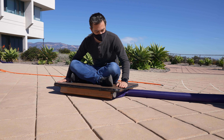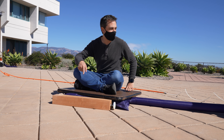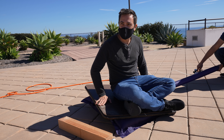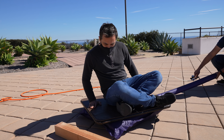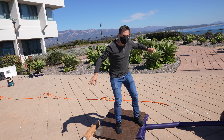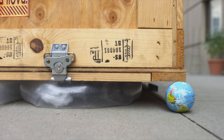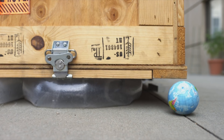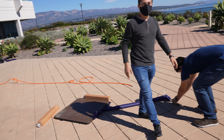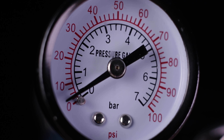So it grows underneath the table just as usual, and then as the pillow part starts inflating, it can actually lift me up. What's amazing is that this doesn't require much pressure above atmospheric. Just a tenth of an atmosphere applied over a large area like a square meter can lift something as heavy as a thousand kilograms, all the while remaining soft. That's the paradoxical thing about pressure — you can get a large overall force with low pressure as long as the area is large enough.